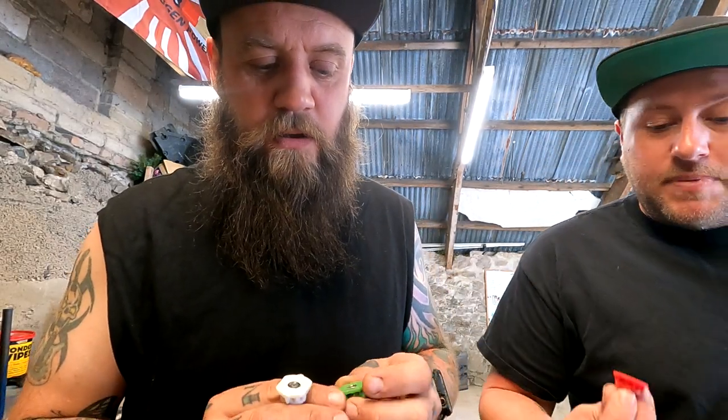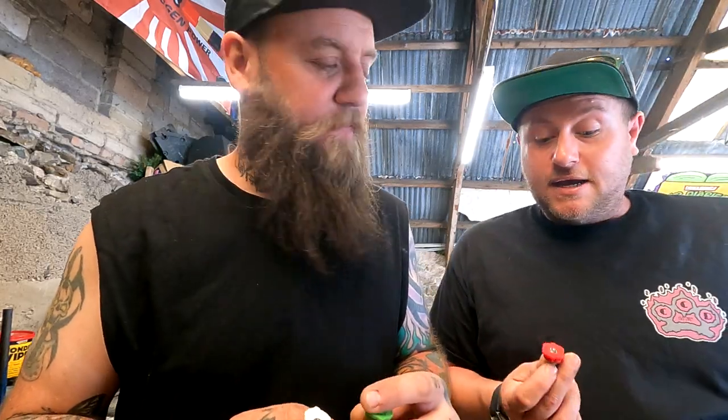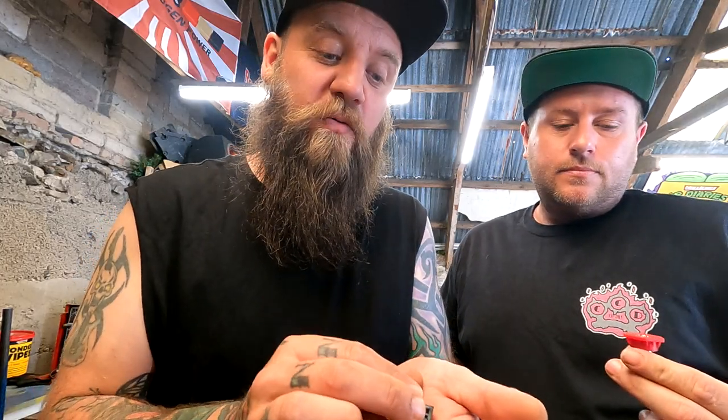Yeah, 40, and 25. For car detailers, which we aren't, but for anyone who buys one, do not use the red one because that one is just a zero-degree jet, just a thin one. We'll show you it on the floor or something, obviously. So you get five of them, and they're all different spreads of jets, and obviously the smaller the spread, the harsher the jet.